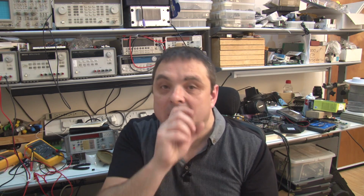So I had a look around on the net and found that quite a lot of people have had this same problem, and it looks like it's a manufacturing problem. There's a connector inside the screen, on a kind of plastic substrate, not like a normal FR4 type PCB, but some kind of plastic material. It's badly soldered, and it just comes away. I think it's the heat of the screen after prolonged use, and it just breaks away. What Apple apparently do is just replace the whole screen. So I'm going to take this Mac from work, which I brought home, take it apart and have a go at repairing it.